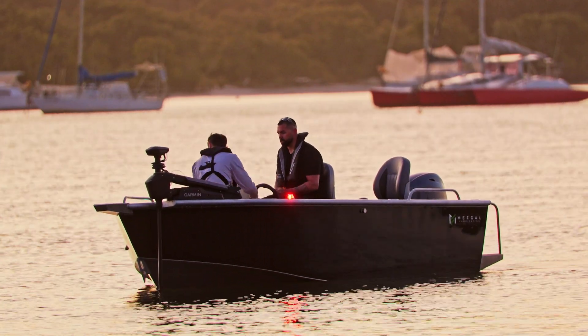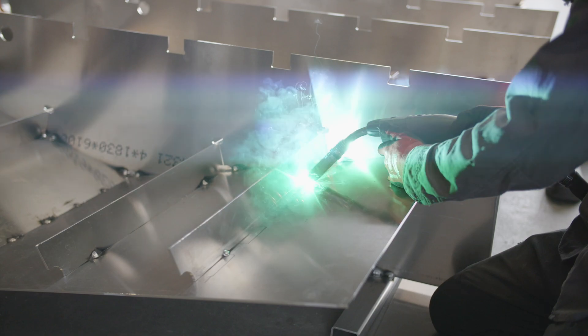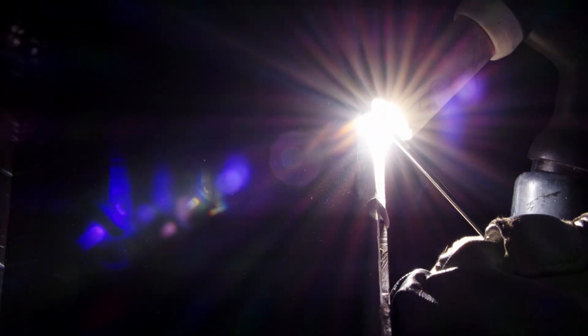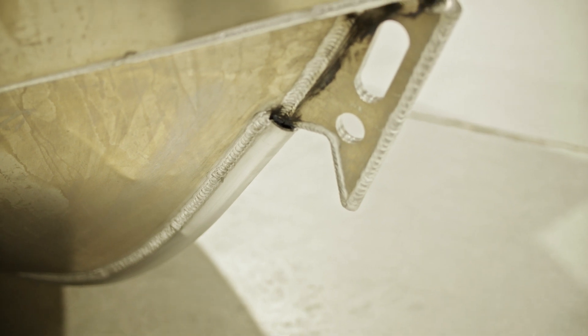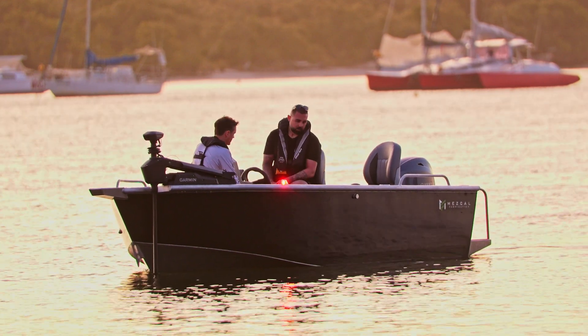That's something we choose to do — we don't like to have to grind any weld off or any structure. Inside fillets we run the pulse MIG, and then any external features inside the gunnels and stuff we like to just TIG it and leave it. It's a nice touch, it looks built — it's sort of our little trademark. It actually just looks like a piece of jewellery.